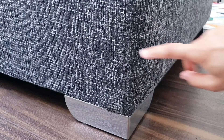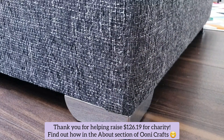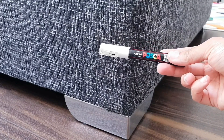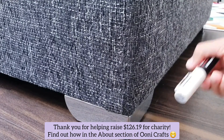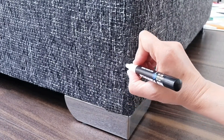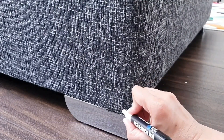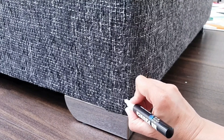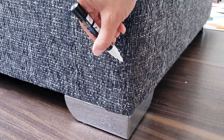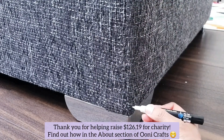And now for the finishing touches. You can see that even though the putty did a fabulous job of matching up to the sofa, it still doesn't have that cross weave pattern which is running through the fabric, and we have to recreate that. For this, I'm using my white Uni Posca pen — you can use any white acrylic pen for this if your sofa has white fibers running through it; if not, just grab a pen which matches the fibers as closely as possible. I gave it a good shake and then, using the tip of this saturated ink pen, I gently touched upon the cross weave pattern I was seeing running through the sofa fabric. I did not trace every single crossweave because that would appear as overkill and perhaps make the corner pop out even more — just a few bits of white here and there.